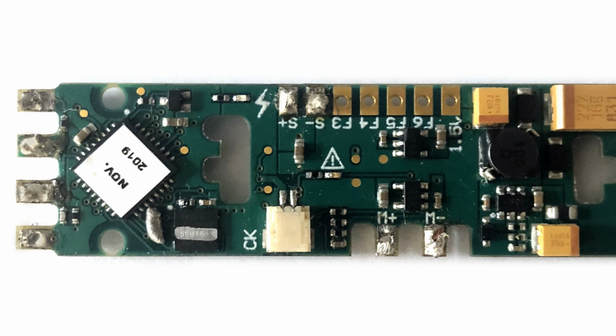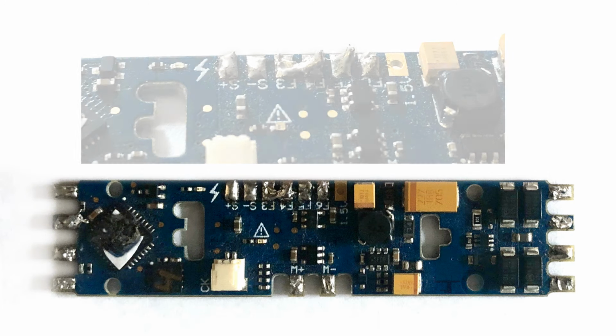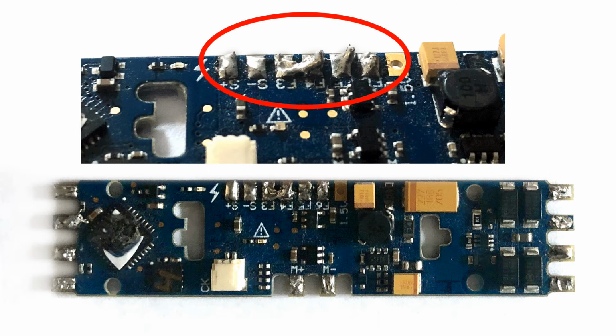All of the examples in the following pictures are ones that we have received in service. Our first one is messy soldering. When you have too much solder on your iron, it drops on the board, as you can see in this example. This would cause shorting out of our circuits. The next example is bridging across the pad. Always check for this because the traces go back and once again will short out our circuits.